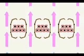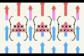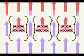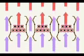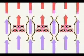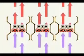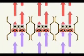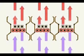Under full load operation, with dampers fully open, all air is directed across the coils. Should the outside temperature rise, the dampers incrementally close, allowing some air to bypass the coils and creating turbulence that promotes downstream mixing of warm and cool air. Should the need for heat drop further, one row of coils can be completely shut off, and the dampers reposition themselves to direct appropriate airflow over the coil face.